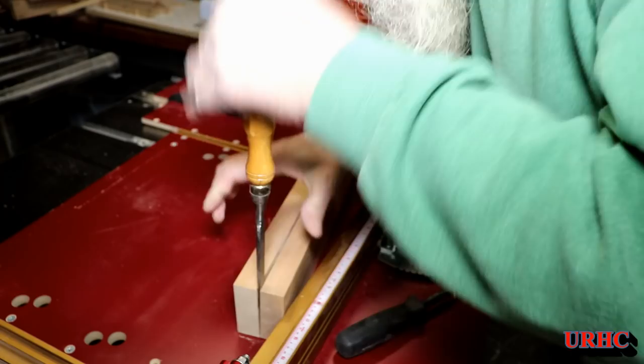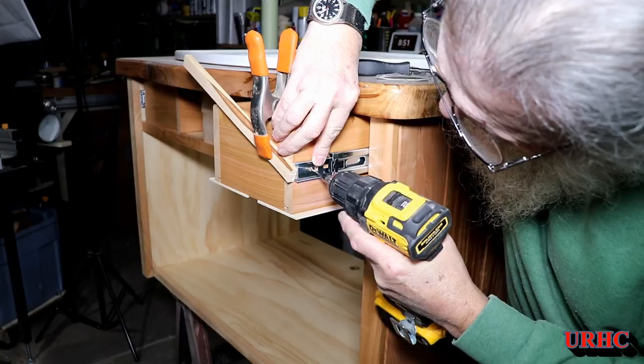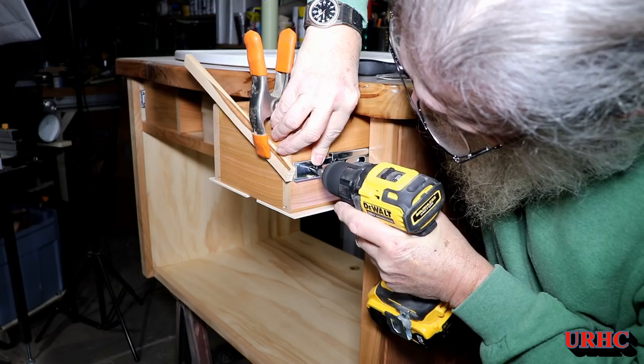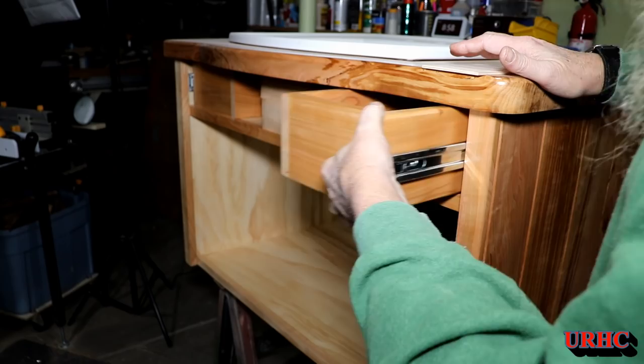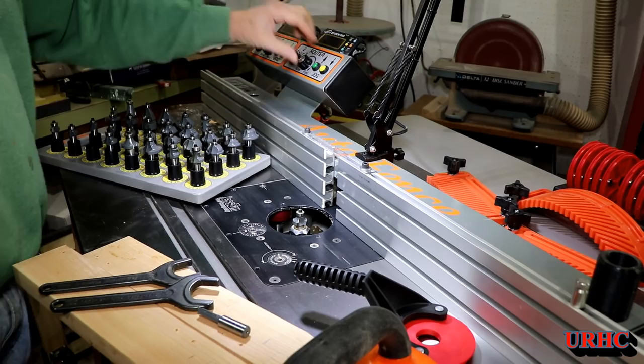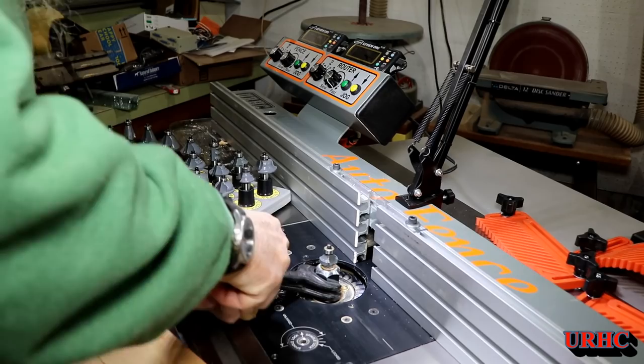The tape did stick well and worked good. Meanwhile, all the drawer polyurethane is dry, so it's time to start mounting the drawers and put some 3mm spacers under them for the gap to hold them up. Everything is kind of temporary until I get the front on, but I aligned them all within the cabinet and put the screws in place. Same thing on the other side — and that one is an inch wider.